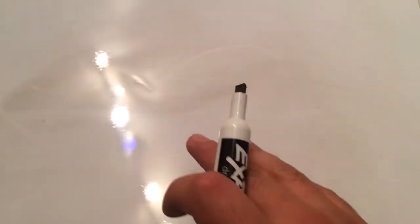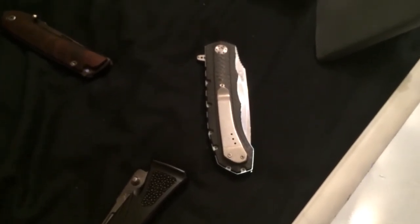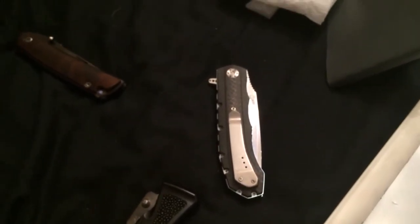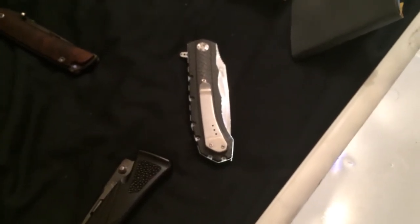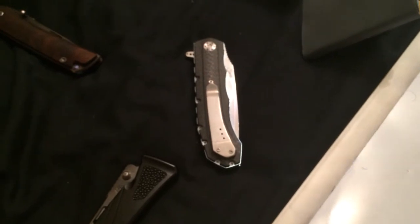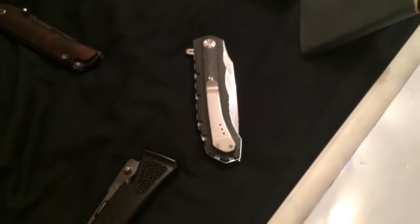So with that in mind, with my first method of 2000 grit sandpaper sharpening, I'm doing that essentially with the convex edge. Now, some of the areas that I needed to sharpen were not... basically, the sandpaper would not have gotten rid of the rolls and whatnot. They were just too much for the sandpaper to handle, and way too much for a strop. So that's when I had to pull out the ceramic stone.